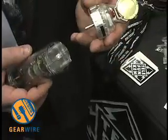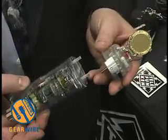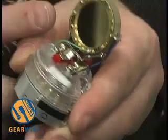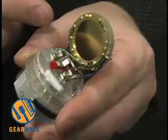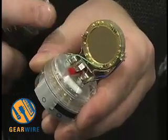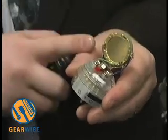What we did was we first tooled up — we did the plastic parts, then we did the metal parts, and then we went into the capsule design. The capsule is a historically accurate CK-12 capsule. All of the parts found here are to original tolerances and tooled up. We make these capsules in Connecticut by hand; they're tensioned and diaphragmed by hand, and we have a process engineer that does this day in day out for us.